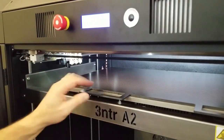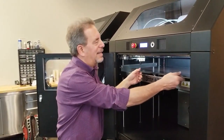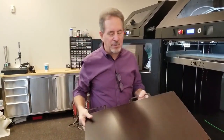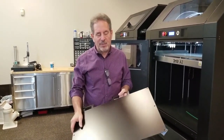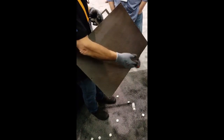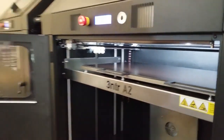One of the things that we like most about the printer is the unique print bed. This print bed is held on an aluminum platform that comes leveled from the factory, and it's held in place by neodymium magnets — you basically just pull it out. The print bed is carbon fiber with a layer of PEI or Ultem over the top. This enables the parts when they're hot to stick and stay in place, and you just cannot remove them when they're hot. When you're done printing, it cools down very quickly and you can basically just slide the parts right off the print bed.